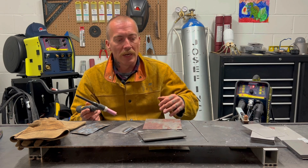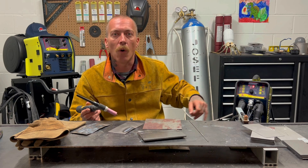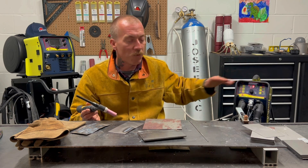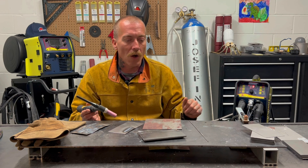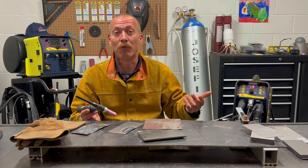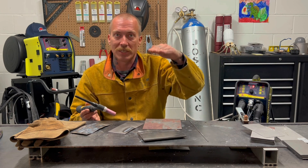The good part about pulse is that you can set the high and the low on the machine. Just for theory — say the high I want is 50 amps to weld on this. I can turn the low all the way down to zero, I can turn it to 5, or I can turn it up to 49 and have it just dip slightly.